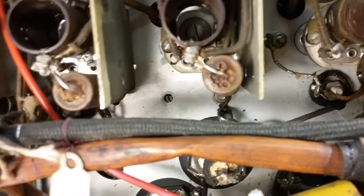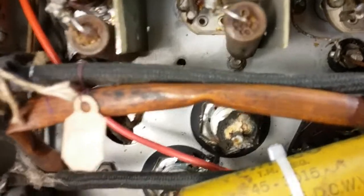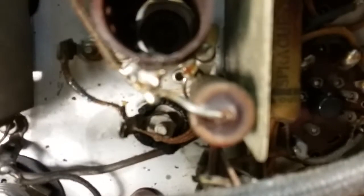so the pressure of the melted wax, the tendency of the hot melted wax would be to run down this way. Imagine the top end, it would be countersunk. Like this one is kind of still in good shape, still kind of countersunk. As are these. You see, gravity might have made that one swell down, but that one there still looks nice. Of course, these capacitors are a disaster waiting to happen, so they've got to be changed.